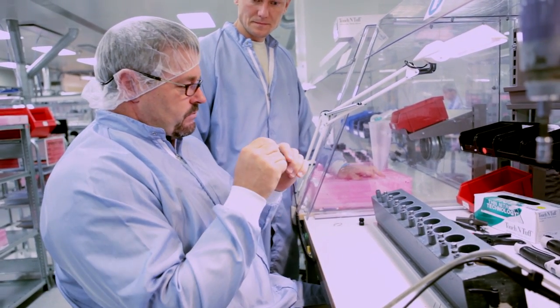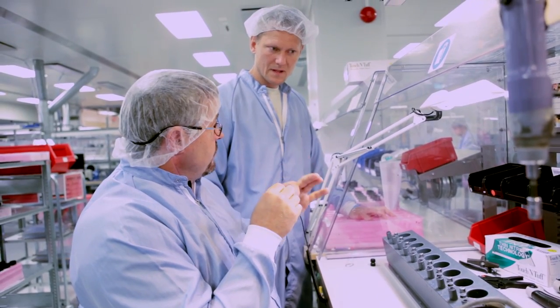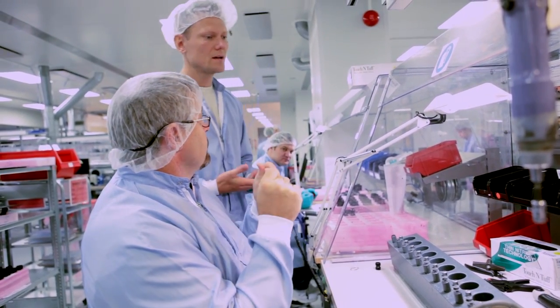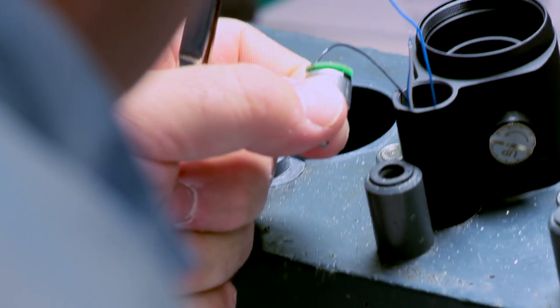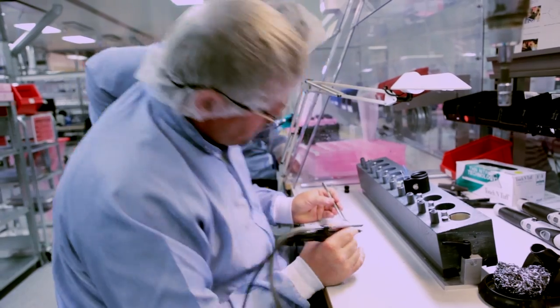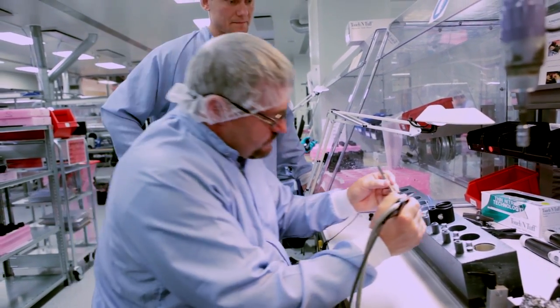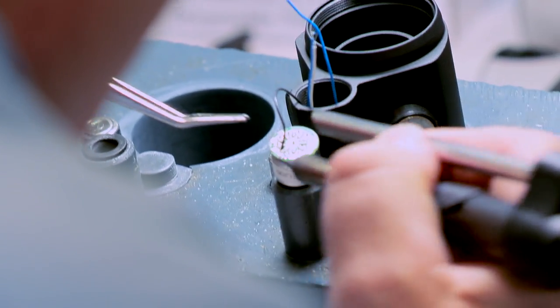The other thing I saw — you put the solder in, and then do you heat it back up as you put the wire in? Yeah. You have to heat it up. It sets up real quick. And it's a lead-free solder, so it's a little bit sensitive to heating it too much. I think it's out a little bit too far — it's a little bit tight. So heat it and put it down a little bit more? Yeah.